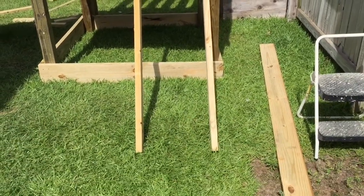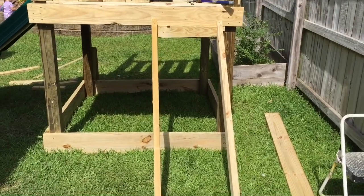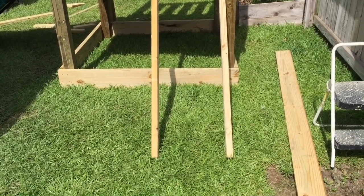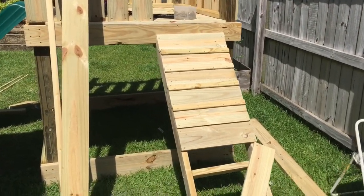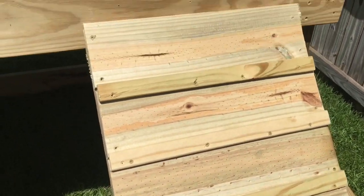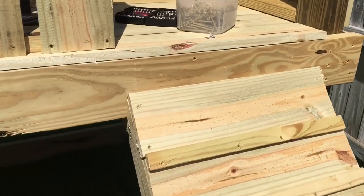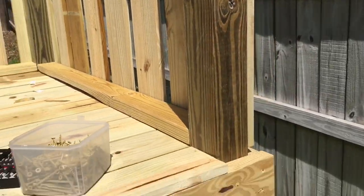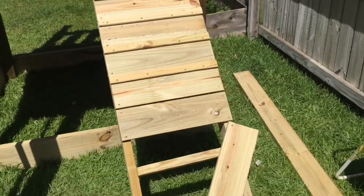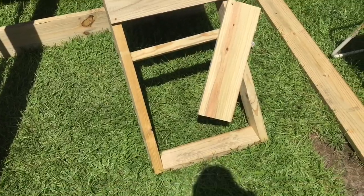I'm tying them in, then I'll put some bracing in the middle and at the bottom. Then we'll lay the tops — it's going to be more like a ramp than a ladder so the girls can walk up and have little notches to get their feet on. We're almost complete with the ladder build. I used two-by-sixes and put one-by-twos in the seams for the girls to step on. There's a bit of a gap between the end of the ladder and the ledge, but I'm going to put some handles here and on this four-by-four, and then put a rope or railings on the side for the girls to grab onto.